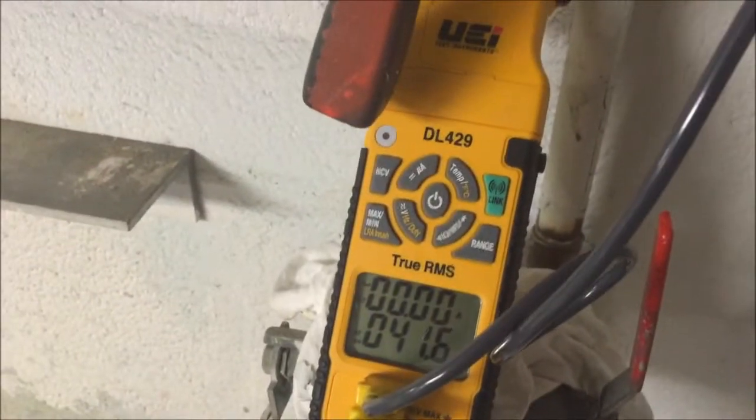The Fluke did not cause the same reaction. I'm getting a differential and I am on the copper. So now I don't have two of these Flukes to test, and I've read somebody said they had an issue with the Flukes doing this. It did change there — hold on — yeah, 75, the water's just getting a little cooler. It's not doing anything. So the Fluke probes aren't having a reaction to each other. It's the Cooper Atkins with the DL429 — they have a reaction.